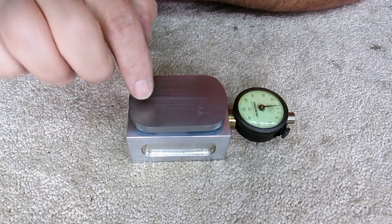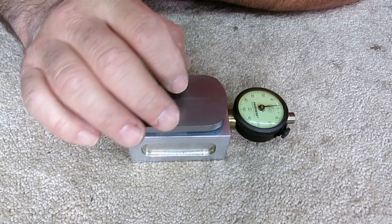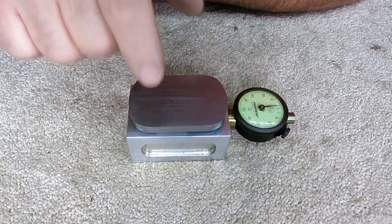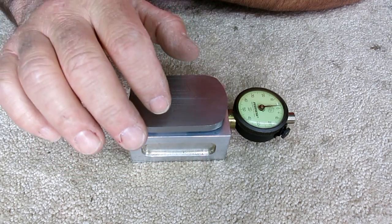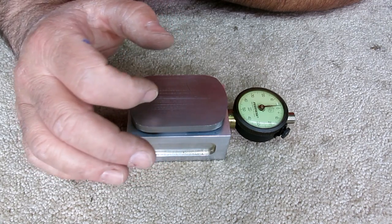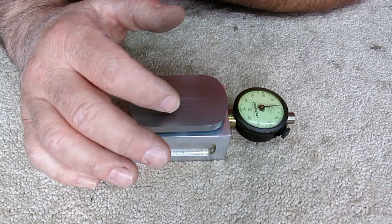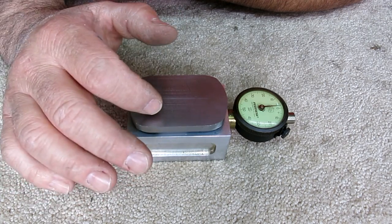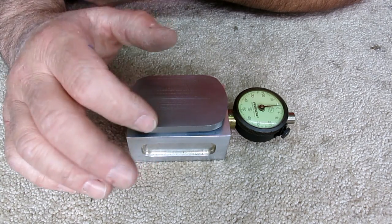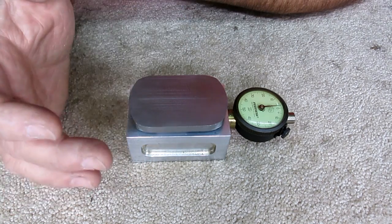So what I wanted was a large table surface so I could bring face mills down and touch off, right? So many times face mills have one insert that's hanging lower than the others, right? So if you inadvertently touch off a face mill and it's not running, for example, you're not using a laser probe or something like that, you can pick the wrong tooth, and it's a few tenths different than one of the other two. So teeth, cutting edges, teeth.